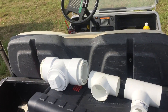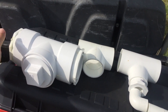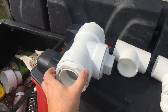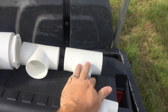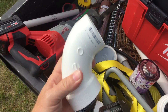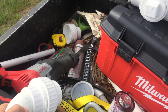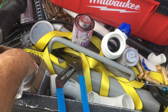I'm going to start gluing this up. Unfortunately my GoPro is acting up today, so I'm doing this without a hands-free camera again — it tends to do that when I need it. I'm not going to show video of me actually doing some of these steps. I'm going to solvent-weld these adapters on here, and those aren't going to change. And then I'm going to solvent-weld these street 90s onto the fittings. After I get this all glued up I'll come back and we'll start putting the rest of it together.